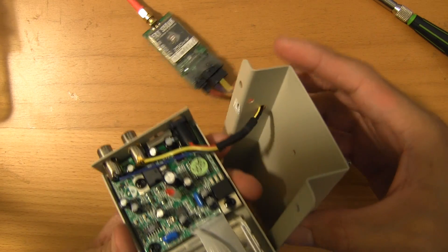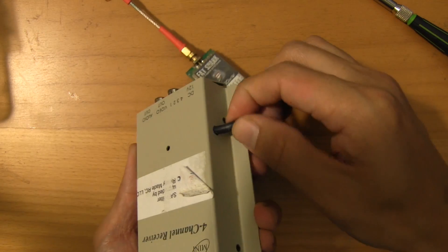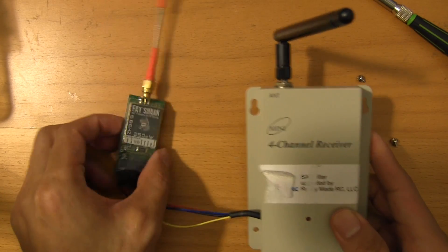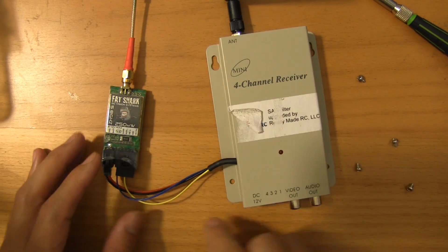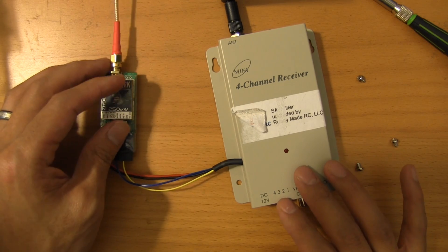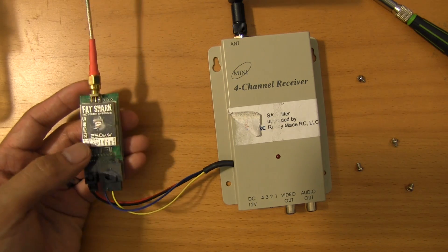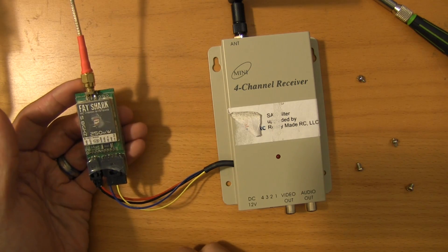What I did do was drill a hole in my top plate just to keep everything kind of neat. Once you're all set and ready to go, you will probably see a little bit of banding from the currents going through. It might help to throw a little snap-on ferrite filter there. It doesn't make the video unusable, but you will notice it's transmitting some of that interference. That may actually be because this is a Fatshark 250 milliwatt transmitter. I don't see that kind of banding with the ImmersionRC 5.8 GHz transmitters — they tend to have better output filtering.